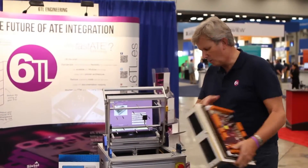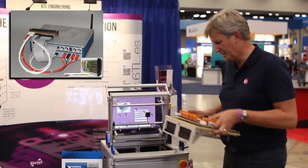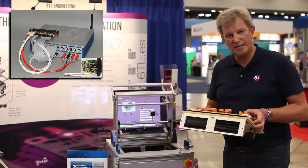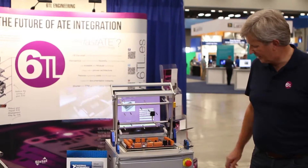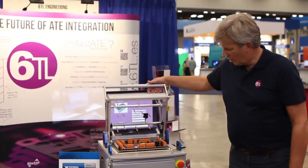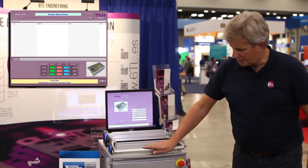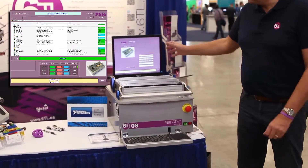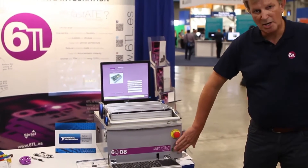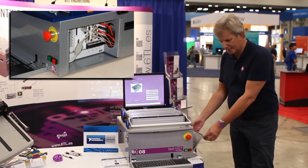This cassette is inserted in our test system. The test system again has a Virginia Panel style interface. In this case, we use the NI Virtual Bench to create a PCB test station. We have options to incorporate a PXI rack in the same system as well. The way we start testing is: put the cassette in there, engage the interface, close the linear pushing system. It's important to push the PCB linearly onto the bed of needles, close it, and then normally it runs the test program. We have a keyboard if you need to input information into the test system — control, start, stop buttons, emergency stop — everything is here. If you have a PXI rack, we have access from the side.